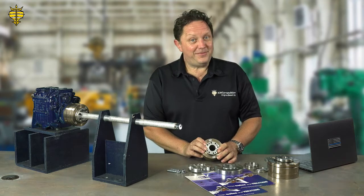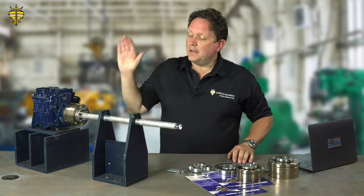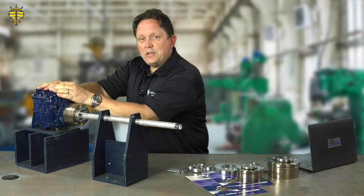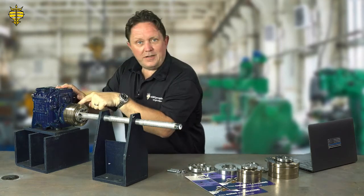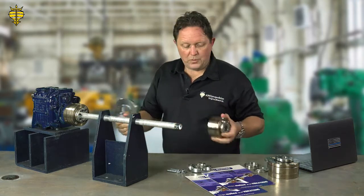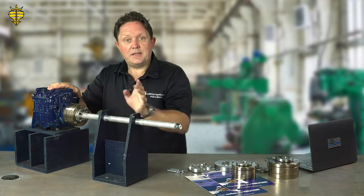In review, that's Sigma Drive — it's awesome. To get one, I need a few things from you. Read the report — it's very useful and a great source of information. To fit a Sigma Drive, we pretty much need to know the engine make and model, the transmission — this is really important — the transmission make and model. These are always rusty, and the plate's gone off the top because we need to know the output flange. The output flange is critical because it can make the difference of needing an adapter flange or just a straight fit. Once we have the transmission, we can size the diameter, and then we need the shaft diameter. Once we have all three things, we can size the Sigma Drive.